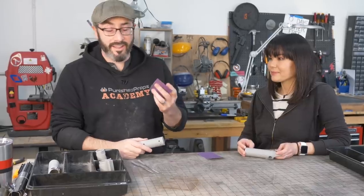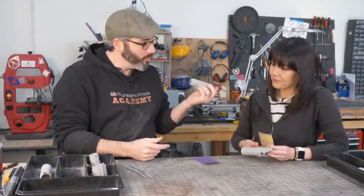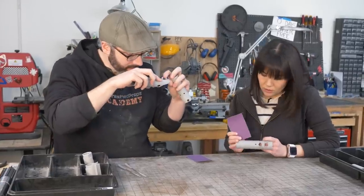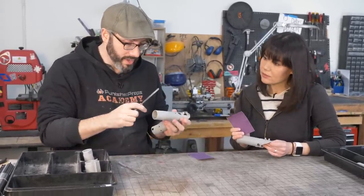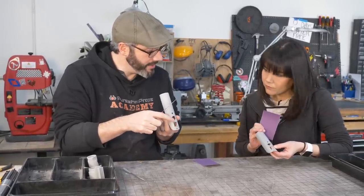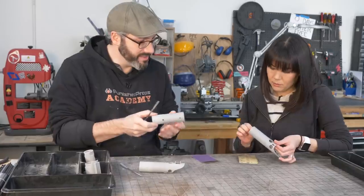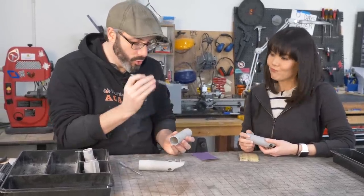Awesome. Our sanding adventure starts with 220 grit sandpaper. Sweet. So the goal here will be to get rid of all the layer lines if we can. There are some really tiny bits, like these little things here, so we wanna be careful around those. And then I also have some needle files to knock down any offending bits. There's some spots where the support material touched down. It's a little gnarly. We can work on that. And then sometimes there's a lip that needs to be removed so pieces fit together. And again, that needle file is gonna be our favorite tool for the job.